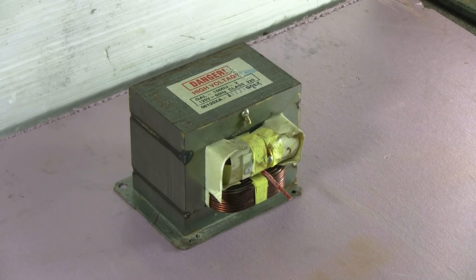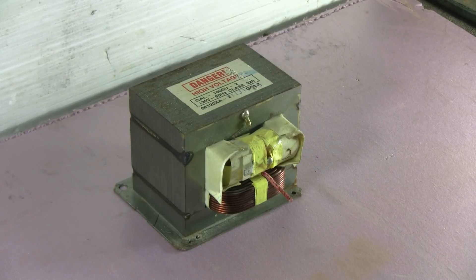This video is about microwave oven transformers and how to determine the high voltage output of a microwave transformer. This can be difficult for a lot of people because the MOT puts out about 2,000 volts, usually somewhere between 1800 and 2200. If we're just pulling arcs we don't really care about the output voltage, but if we want to make a high voltage power supply for charging capacitors, amateur radio use, or similar, we might want to know the output voltage.